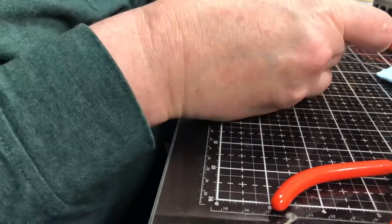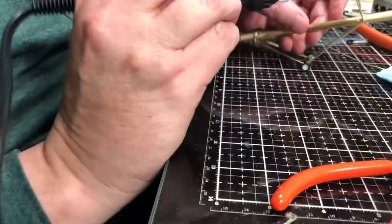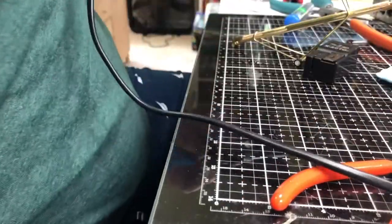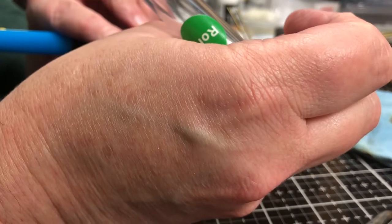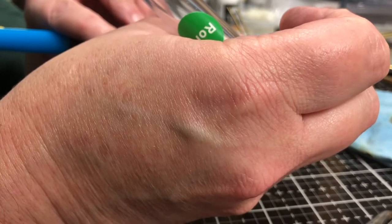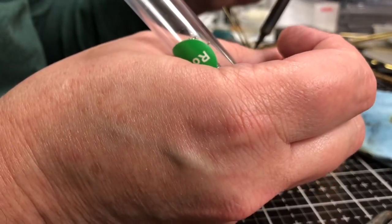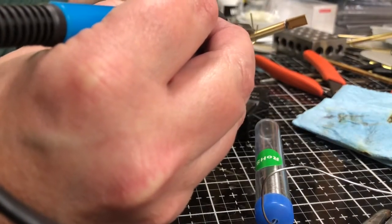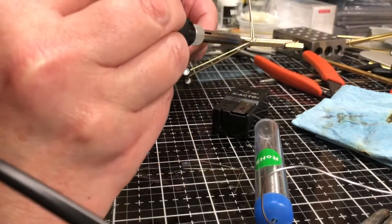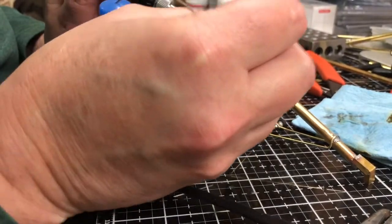I put a little flux on there so that the solder would reach in there a little bit more. It's a little bit harder to solder on the brass than it is to do like wires or something like that — stranded wires or anything. You really need to take your time and heat up the area that you're dealing with a lot more. With that in mind, the soldering iron itself is actually hotter. I forget exactly where I set it, but I set it at a higher temperature.